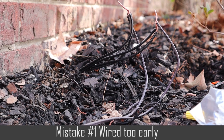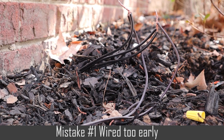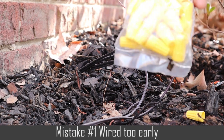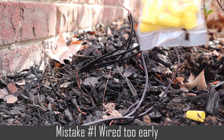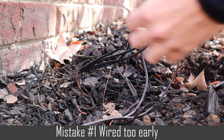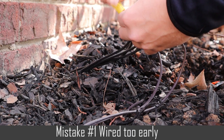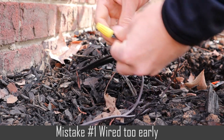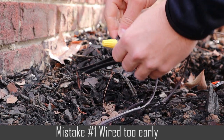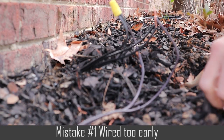Over the years I have learned that you just don't wire up the light to the wire just because it's there and you ran a wire to it. You need to make sure that you have all your ducks lined up in a row, because what happens if you actually need another wire there? Well, you've already wired it up. Now you have to cut it up, add that next wire, and then rewire it up. So you're gonna give yourself more work by jumping ahead of yourself.